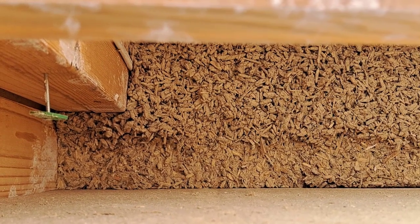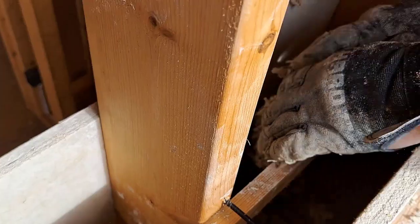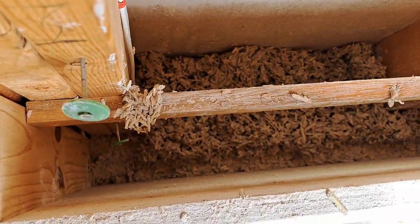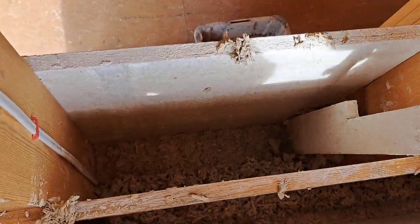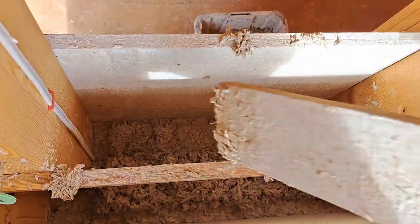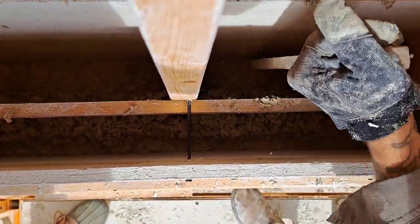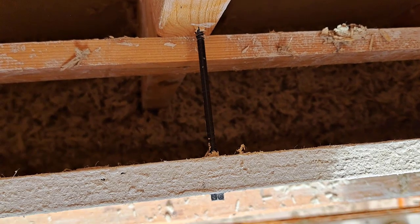Combining tight-packed outsides gives you that thermal mass similar to brick, and on the inside you're leaving it fluffier. The density determines thermal insulation — the more binder you put in, the closer it is to an ICF or cinder block home. When building for different climates, that's something to consider. In Michigan you'd probably want denser packed walls for better thermal mass, so when it's sunny during the day it warms up and releases heat at night. In a more temperate climate you just want to resist temperature change from outside to inside. It looks low-tech but it's really high-performing.